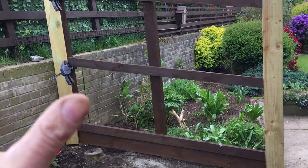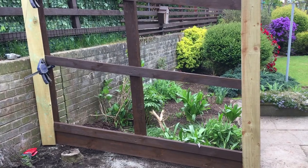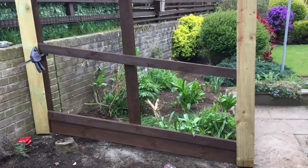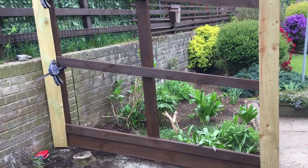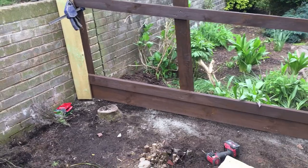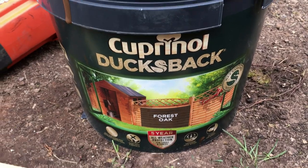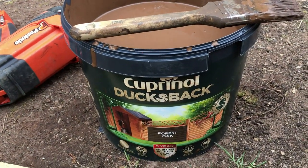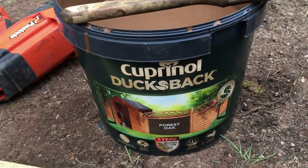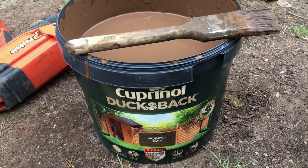So I tend to fit the posts, fit the rails, paint them all, put the first row of slats on, get all them painted front and back. Then before we put the other slats on at the back, we'll paint one side of those, fit those, and that makes it a lot easier - that just leaves you the reverse side to paint. The paint I'm using for this - I always recommend Cuprinol Ducks Back. It's a good paint. I always put it on by brush when I'm painting fences. Spray ends all very well, but you do tend to get a patchy finish. If you work the paint into the fence with the brush, I think you get a lot better finish. It's a bit more time consuming, but that's okay.